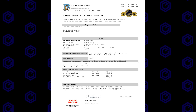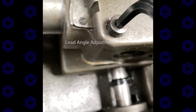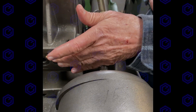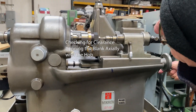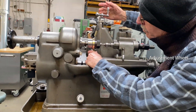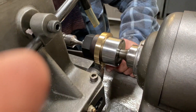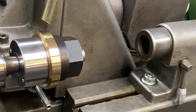The hob and the gear properties are really important — how you set the machine up and whether they match your designs and plans. We're going to go through setting up this machine. This is a hobbing machine, some Micron, and there are a number of little settings on it that you adjust: where the hob runs axially and longitudinally, how the lead angle is set, where the controls are. It's a neat Swiss machine, known to be quite accurate — most gear shops you'll see a bunch of these.